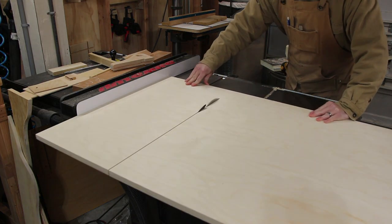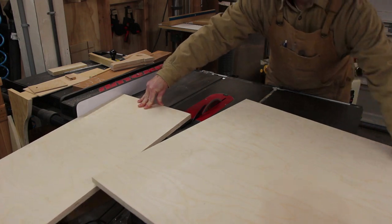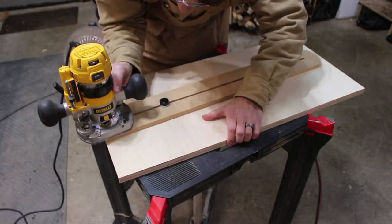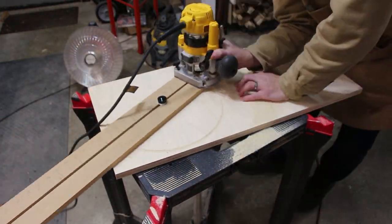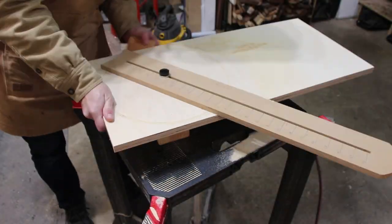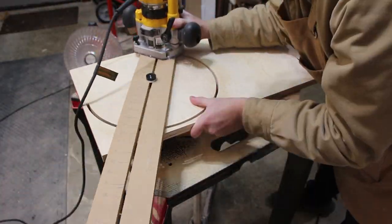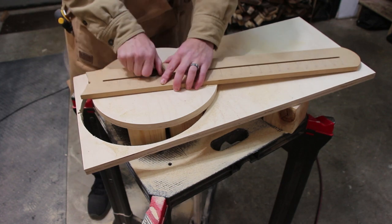The first step was to create a circular wood base for the logo out of plywood. I cut this circle out using a simple circle cutting jig. First you drill a hole in the center of your circle, then pin it with the jig and the router rotates around that center hole. After two passes I had a perfect circle that was about 12 inches across.